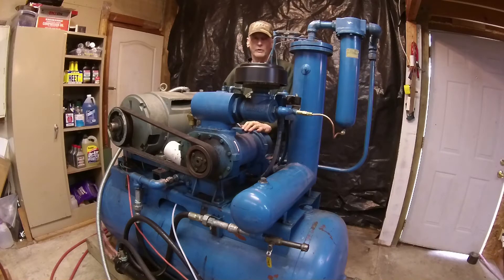The main issue I noticed right away is it uses 80 percent of the current even running completely blocked off. So if it's not producing any air whatsoever, you're drawing 80 percent of what it would at max air output. Some people say you can convert these to block it off completely and unload the tank to get the amps down — I don't know if that's really worth it, but that's one of the things I'm going to experiment with. Right now it's set up to modulate — it'll keep the air pressure at a hundred pounds and run there.